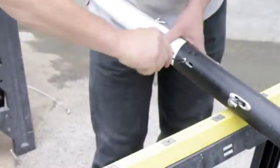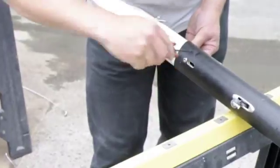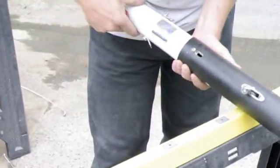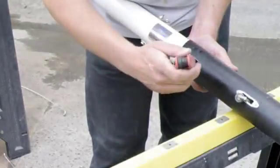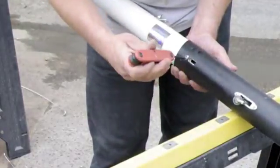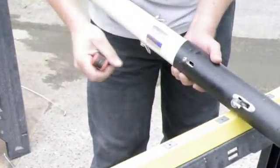When you're pushing this in, try and make sure that you're not pushing the T-terminal backing plate in behind here away from the mast with the thread, which is why it's important to ensure that the bolt's actually picking that up. If it pushes it away, that plate behind can just drop out and pull down your mast.